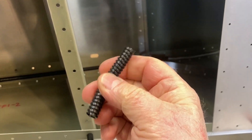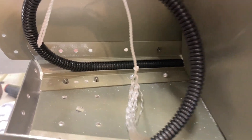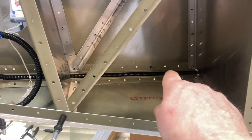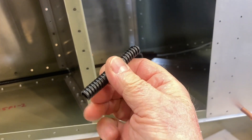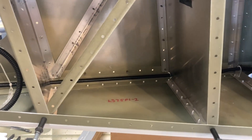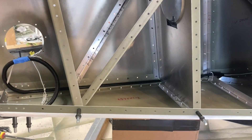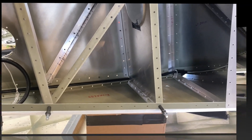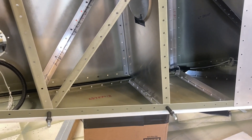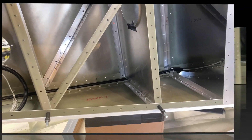Another quick thing: this kind of material that goes around wires collapses and pushes back, and it fits right down inside the channel of the longeron. So when I pull my wires through those eyelets that I made, that last little bit can fit down tight right in that corner. If you don't worry about it being in a casing for letting heat off the wires, you can put it the full length and it works as a conduit. I'm only going to put it in just from here to here, and then somehow this will wire up at the rear tail. With DC I don't think we have too much to worry about with heat, but that's the primary reason conduit is good - it's very protective, but it also seals in the heat that the wire makes, so it doesn't cool well.